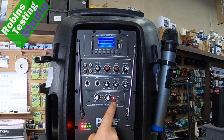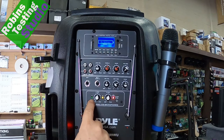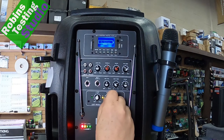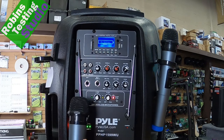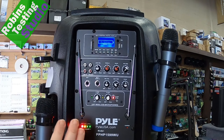Down here, because it has wireless microphones built in, you have the ability to turn on the wireless system on or off. As you turn microphones on, one mic will come up indicated as an amber color, and the second microphone is indicated by a green color, so you know which one's on. All I need to do is turn up the actual master volume and I know I'm working — I can turn that one up and down and adjust it the way I want. They are UHF microphones, which are really nice, and they are set with a digital link. It does take a second for it to link, but you don't even notice it happening, and the quality is really good because of the upgrades they've made to this system.